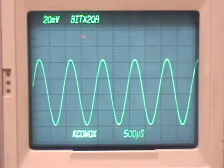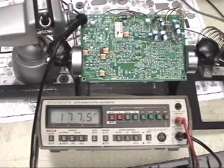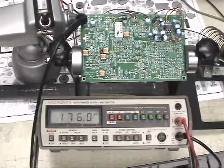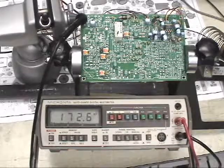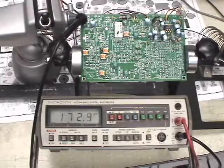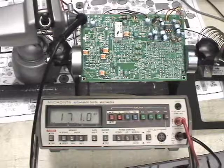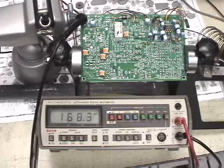You can see the difference in the display once I get out of the noise at the 500 microvolt signal level — the trace looks pretty good. We have the transmit microphone preamp all ready to go. There's a little warning here: it asks you to install a 4.7K resistor R92, but you'd only install that if you're going to use an Electret mic. If you're going to use a dynamic mic, leave that out — otherwise it would put voltage up on your microphone, and you don't want that with a dynamic.